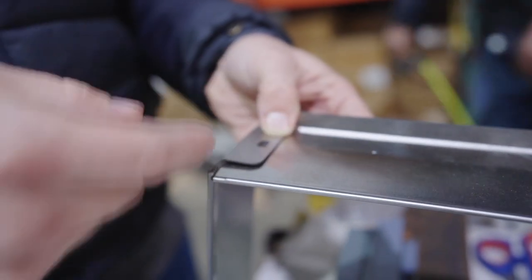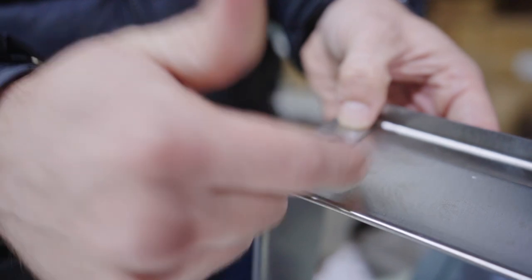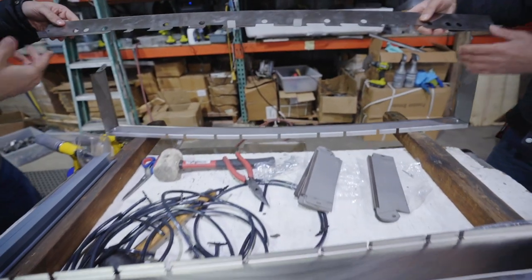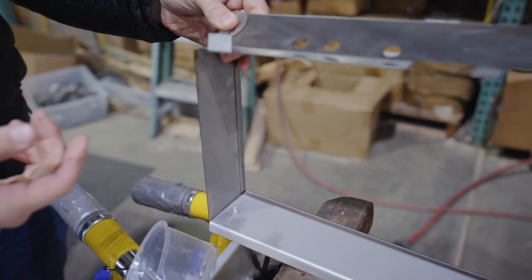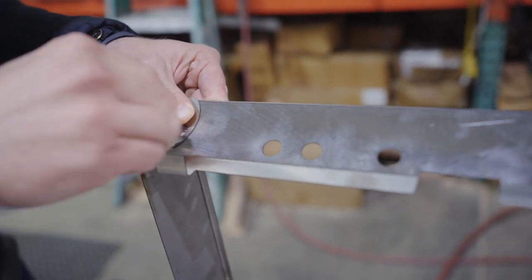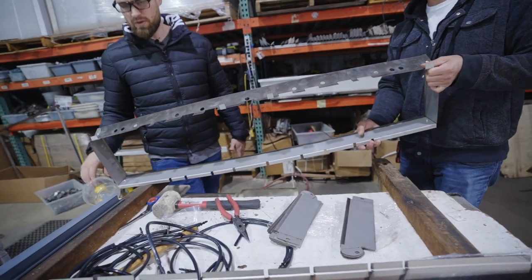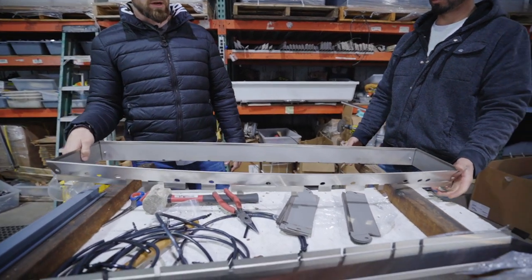This is the backside of the food hopper. The flange that we bent is on the outside of the back piece of the food hopper, and then you're going to rivet it together. For the other side, it's going to be the same thing — the flange is going to be on the outside. Normally you would set up an assembly line and do them all at once — do all the bends at once. When you get your rivet tool, if you don't have an air one, you're just going to crank them out a couple cranks per rivet. Now we've got the food hopper assembled.